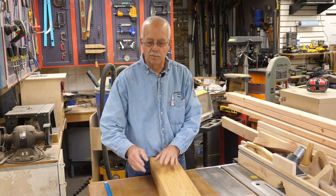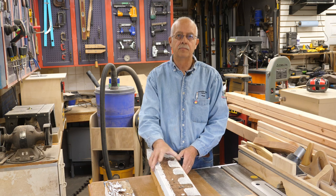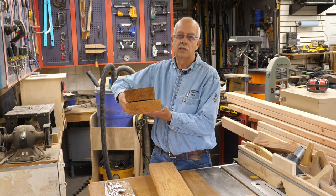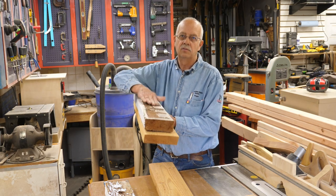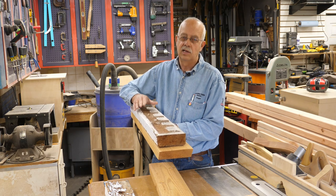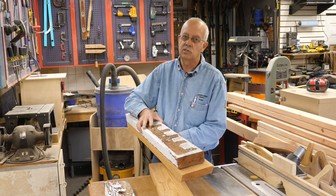All right, now the last thing I need to do before I go out to where this porch actually is that I'm working on. Here's a piece of the stock from the old railing, and I'll lay it on top of the new railing pieces I cut. As you can see, the new material is just slightly wider. I did that because I could not find this exactly. I was really fortunate to find this in a rough cut cedar. And I need to be able to match everything else that's on the porch railings, as you'll see when I get out there on site. So I'll just rip this down and we'll head out to the site.